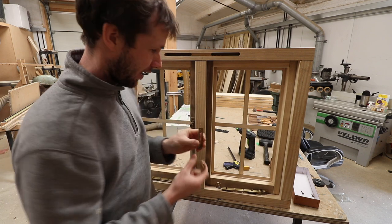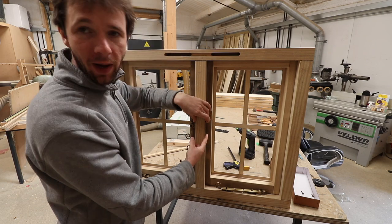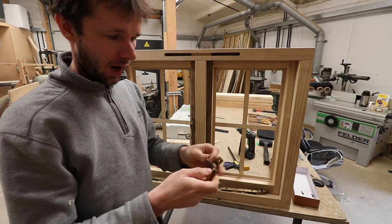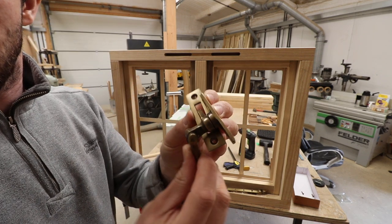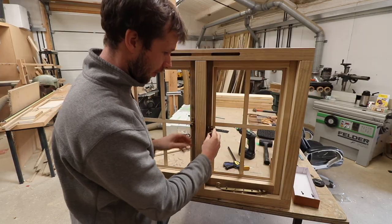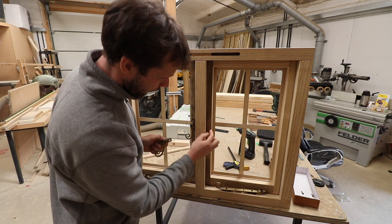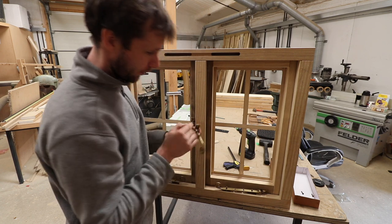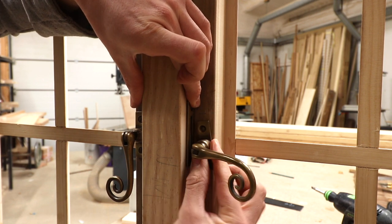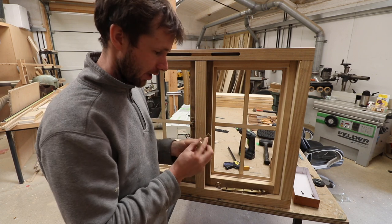We've got a mortise plate and a fastener. The mortise plate needs to fit onto the mullion or the jamb of the window without sticking out past the face when it's engaged into the arm of the fastener. In that engaged position, you need to check that the distance is going to work with what you've got on your window and any mouldings on that surface. You also need to check that there's enough room on the casement itself before the glass starts for you to get a fixing in. If the glass has gone in from the outside, you've got a rebate there and you don't want to be putting a screw through the fastener into that rebate and drilling into the glass because you're going to end up breaking it.